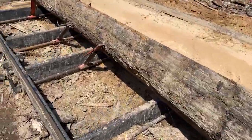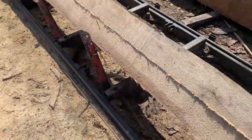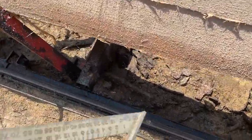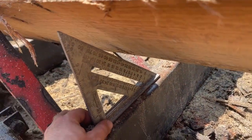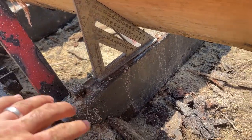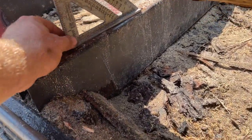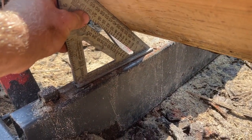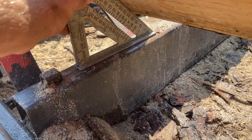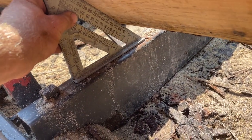Meant to show you guys where the magic happens. So when I stood this up on the angle, I don't think I've filmed it, but what I do is take my speed square and set it right here on the deck and tuck it in against the log. As I roll the quarter up on top of it, it will set and put weight on this speed square, and it won't pop out of there. It helps a lot, because I'm usually rolling from the other side and I can't see